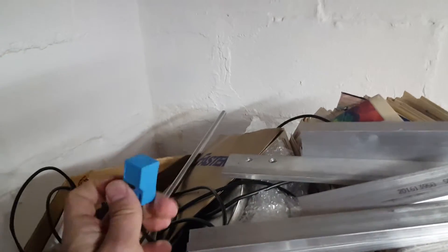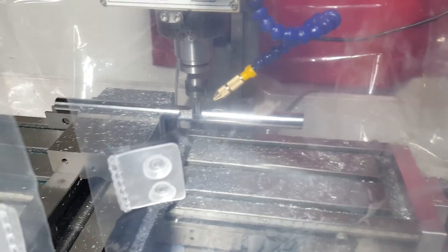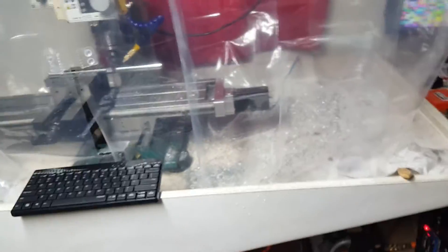There are some limit switches I want to put in — I just haven't yet, because trying to home this thing is irritating as all can be. But yeah, it's cutting through this drill rod very nicely. The coolant mister is definitely keeping it cool — you can hear the difference between coolant versus just air. I've been using just air for the first couple months I've had this mill.